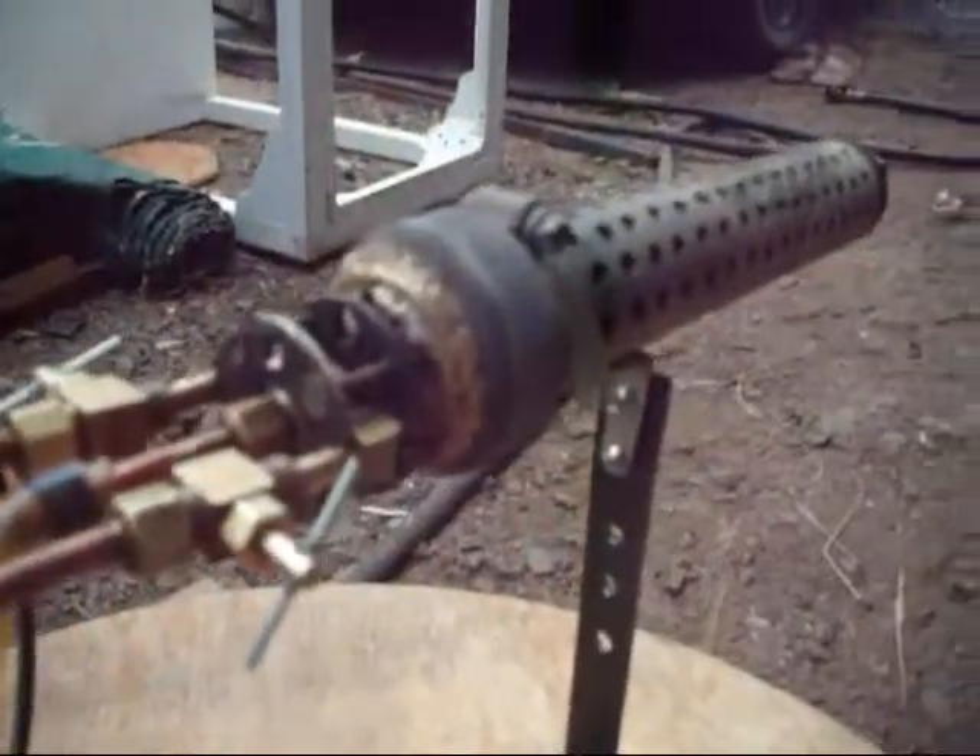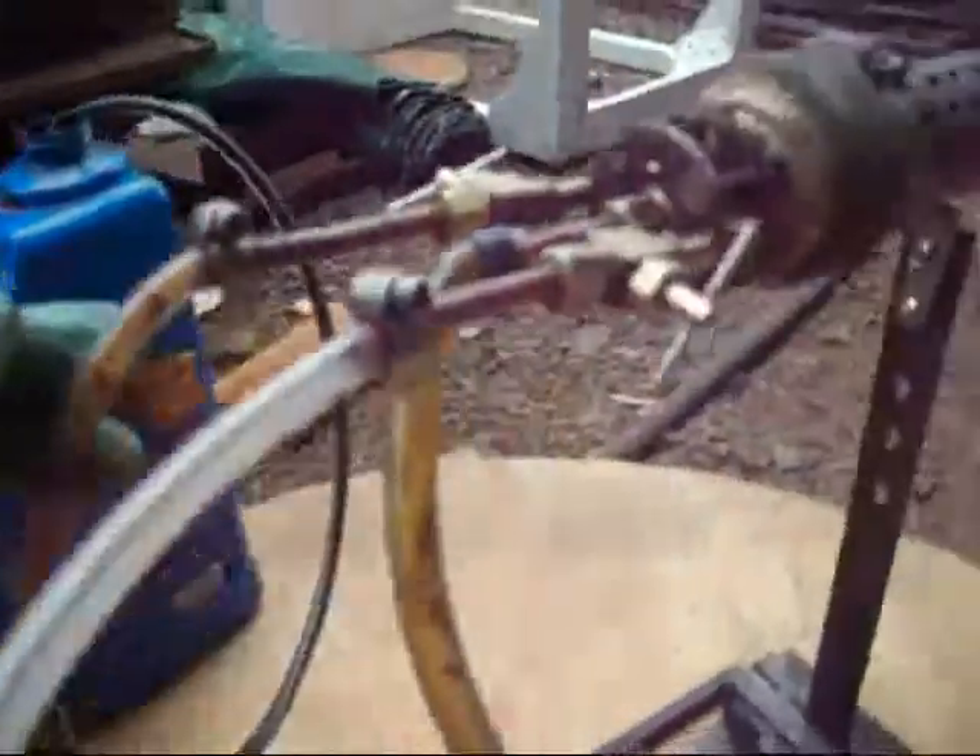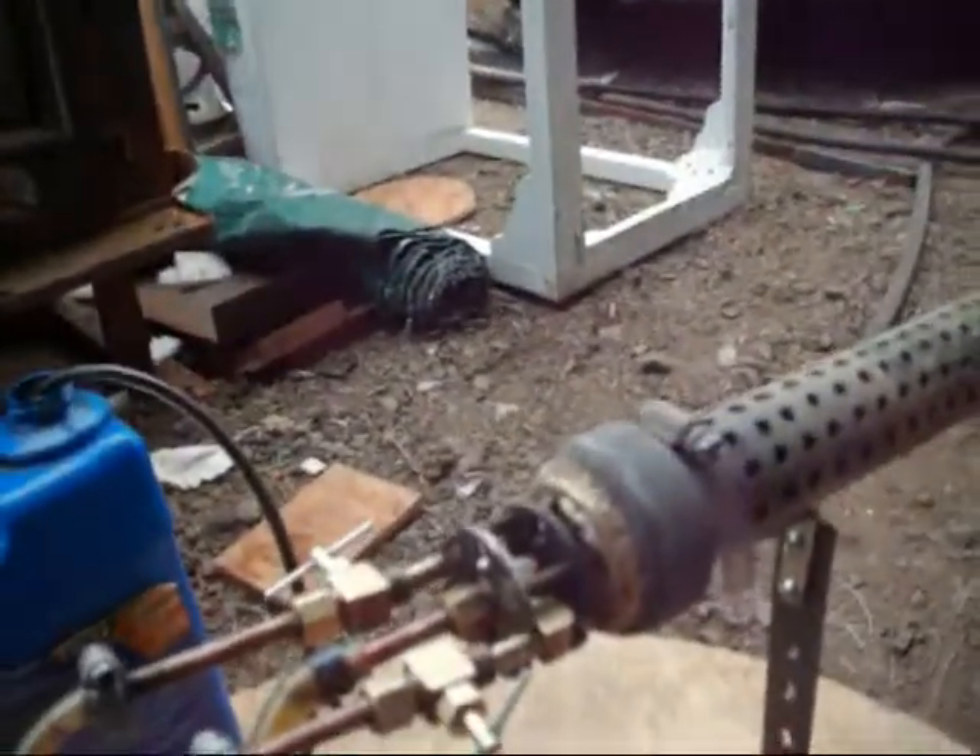Okay, that's it. Now the oil is going to drain back into the tank again. As safe as it can be — once you turn this thing off, the oil goes right back. Check that out — draining back, draining back. So if you ever lose electrical power, there's no danger with this thing. The oil is just going to drain back into the tank — it doesn't get any safer than this. But as I said, the vinyl tubing is about to melt, so these copper lines have to be longer and the fuel lines have to be better lines in order to run this thing longer. Anyway, that's the burner — thank you for watching.